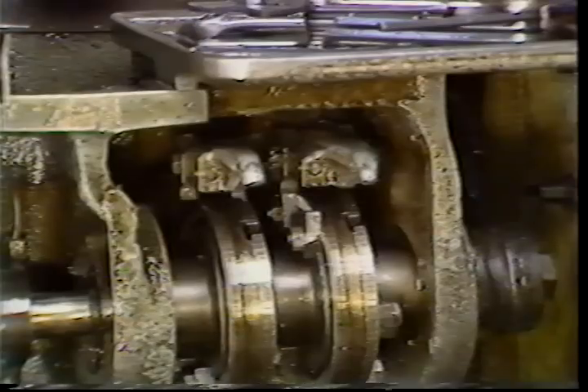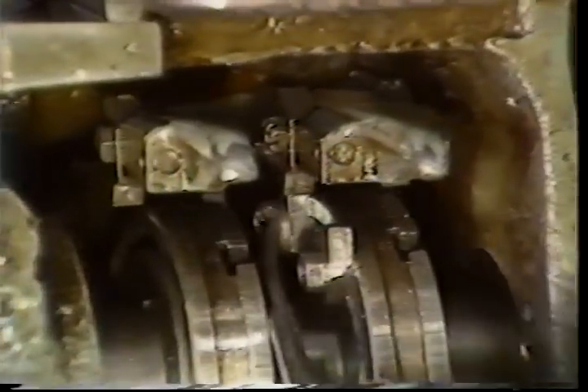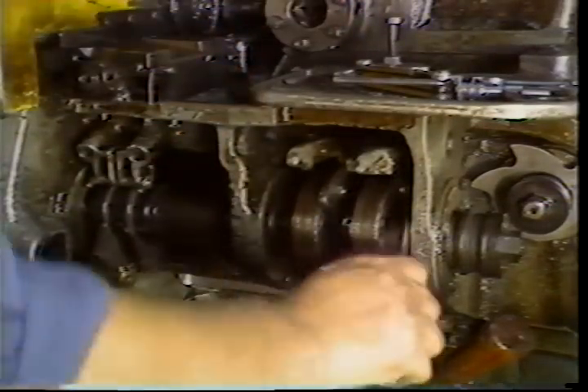The turret dog carrier for the double-ought machine is located here. Loosen the trip dog locking nut. Slide the trip dog in the slot until it contacts the trip lever, then tighten the locking nut securely. Repeat this same procedure for all other index points on the cam. Alternate between both sides of the dog carrier.